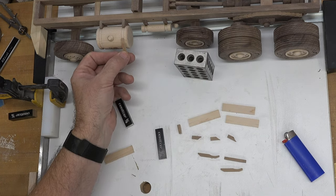Guys, I don't even mess around. I use a digital gauge to measure all of these angles. So I set my 90 degrees actually at 0. This represents a square cut on the table saw. And then if I adjust it here to my angle to line up with our prints, we can see that that lines up perfectly at 8.5 degrees. So that's what I would set my table saw fence or the tilt of my blade to. You can either use this or you can do it manually with a protractor, whatever works for you, but measure these angles and don't be afraid, as I've said many times, to write on your plans. These are your plans. Make them easier for you to read.